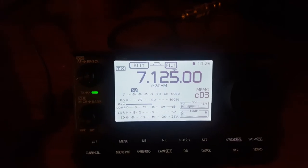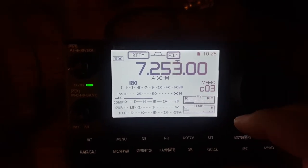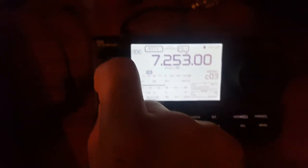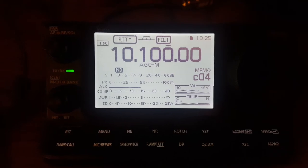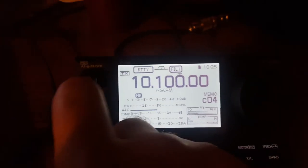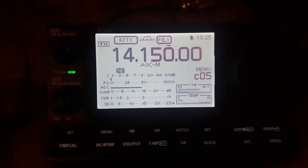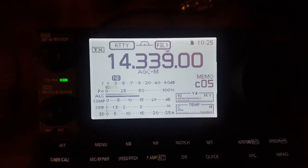Once you start getting towards 40, it's 1 to 1 — you pretty much don't need to go throughout the whole band. Almost perfect match right in the middle of the band. Quick key down on such low power. Propagation today seems to be pretty crummy anyway, so I'm not too worried about interference, especially once I get 30 and above. This is 30 meters, and that was pretty fast — 1 to 1 already. Let's see what happens on 20. Wow, there it is. On 20 meters you can pretty much guarantee that all the way up near the top you still have 1 to 1.